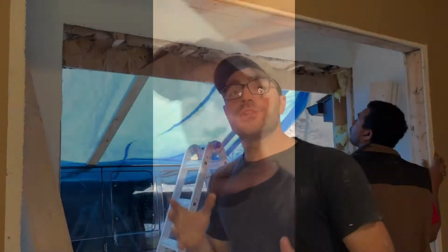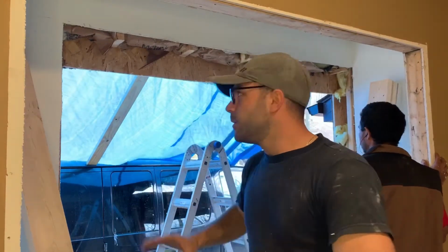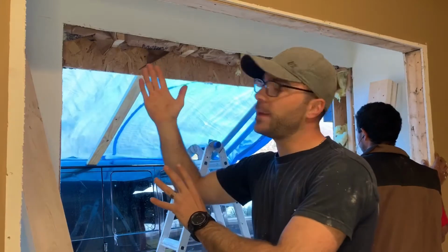The wire down. All right, there they are. Breaker's still off, so that's good. Otherwise I'd be being zapped right now. So just like we did with the doorway, we're gonna do the same thing with the header here. We're gonna put our piece up, and we're gonna bang a board in, and then follow it up with another.